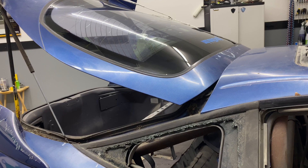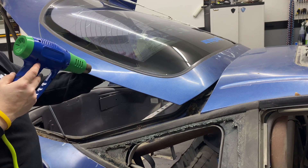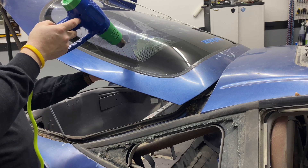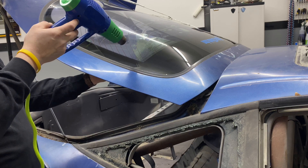So what we're going to do first is we're going to use a heat gun. We're going to heat the outside of the glass — the window film is actually on the inside layer. So we're going to heat it up enough to get the adhesive warmed up so we can peel off as much of it as we can. And then we'll have to deal with the adhesive afterwards.